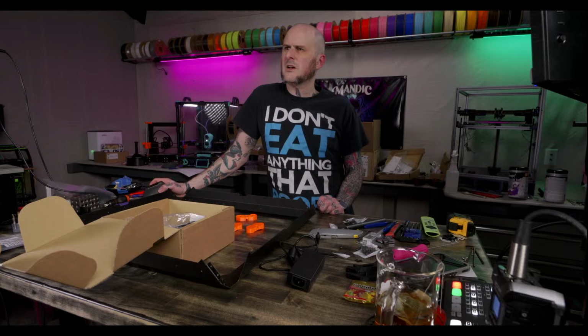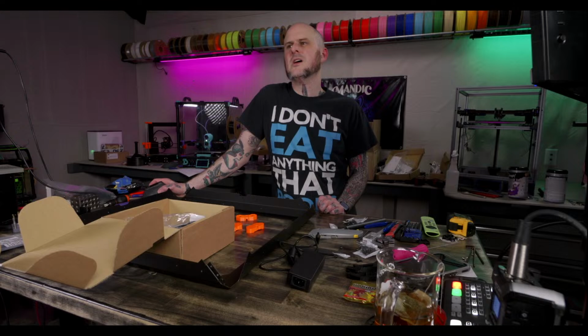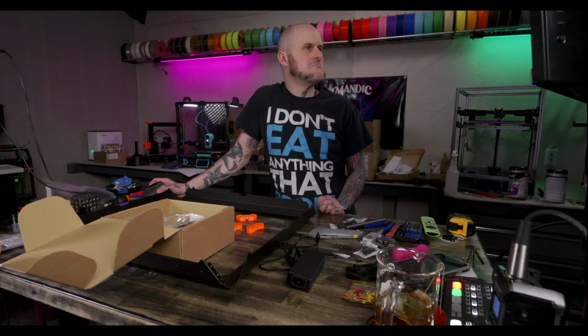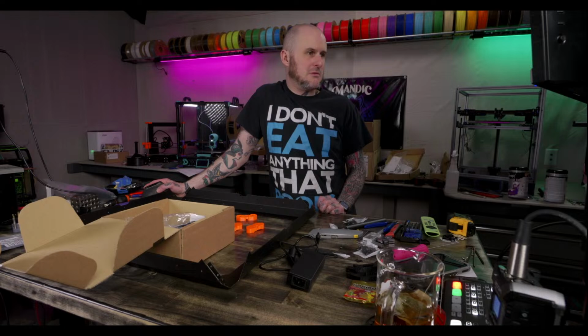Got my roll of Cookie CAD Dark Magic ABS, and the shiz is gorgeous. Love to hear that. Working on your 0.2 conversion. Awesome. For PC, run your bed at 120C and it won't warp. Yeah, I've usually tried like 110, 115, so maybe I should bump the temp up more.